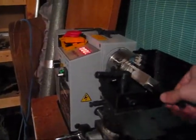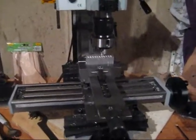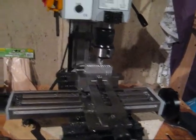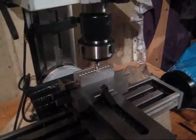So that's three-eighths done. We've got our half inch hole right where we want it. With these boring bars, in your drill it's usually a tiny bit oversized, so it fits in very nicely - tiny bit of play, but that won't matter. Here's the setup for milling the part that's going to get clamped in the quick-change tool holder on the lathe.